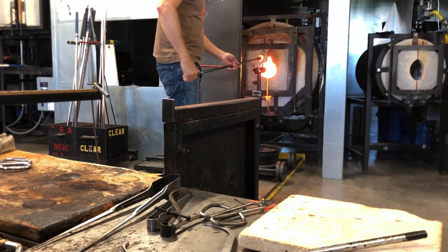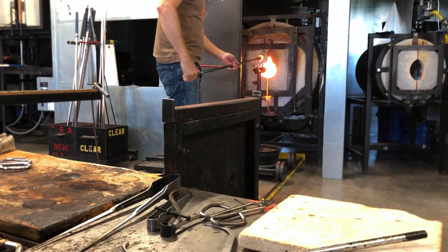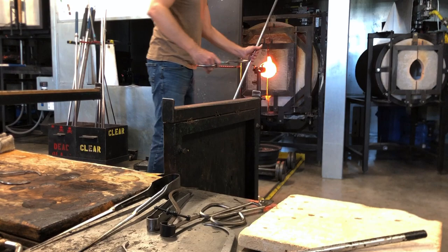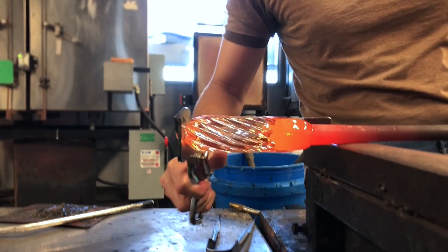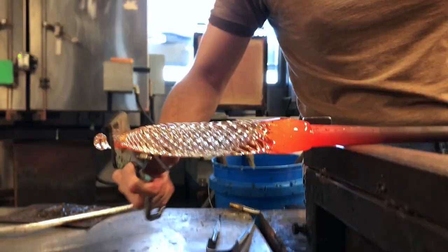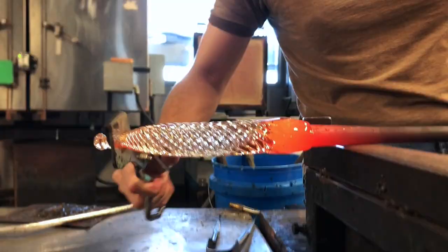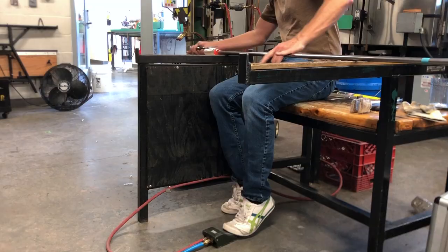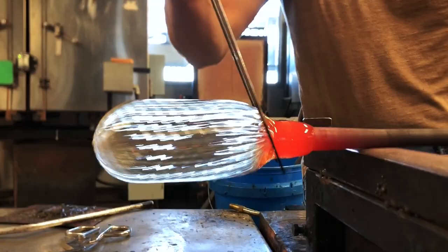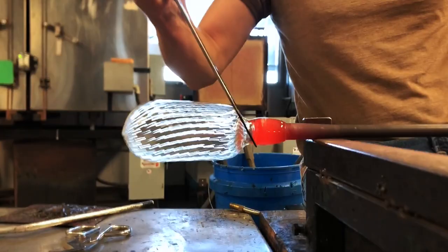You can see two of them there. It's really important when you're pressing into an optic mold that the ribs go all the way up onto the moil, past the glass that is on the blowpipe. The lines are already way up on the blowpipe because as I twist this, they get pulled back off of the blowpipe so that all the ribs are in the bubble. It's critical that when you start, those ribs go all the way up to the blowpipe. You can see our foot pedal system in action here — I'm stomping on that foot pedal, which is pushing about two and a half pounds of compressed air into the blowpipe and then into the bubble.